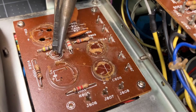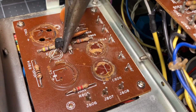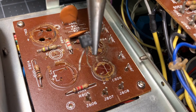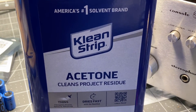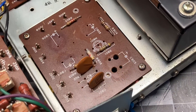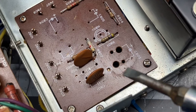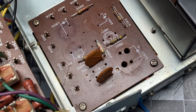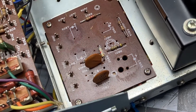And here's our transistor. I thought I might have missed a lead on this — but nope, I didn't. To clean up the glue I used a little Clean Strip — that's acetone. I took a rag and a flat blade screwdriver, wrapped the rag around the end of the screwdriver to soften the glue up, then removed the rag and scraped at it. Pretty easy, pretty straightforward — it took about 10 minutes.